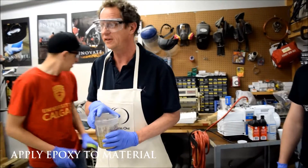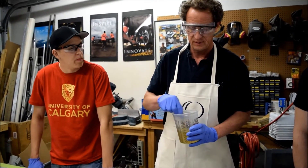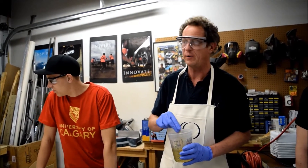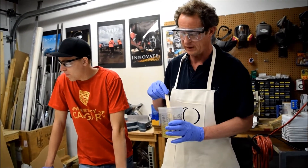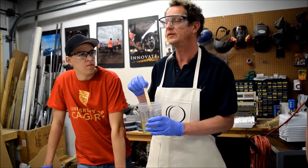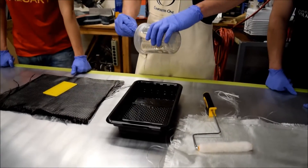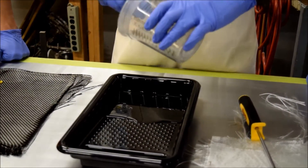So I have a bucket of resin here. Let's pretend it's not 300 mils but 2,000 mils. What's the best way for me to build my own thermonuclear meltdown? Have it all in the same cup. Think about the exothermic chemical reaction — it generates heat. If I look at this mass of resin, it's going to develop the most heat in the center. So the more I can spread this out into a thin layer, the more working time I'm going to have. The first thing is to dump it straight away into a roller tray.